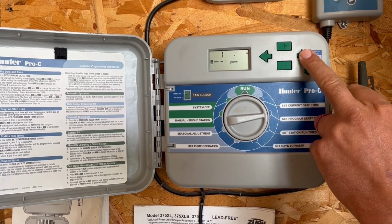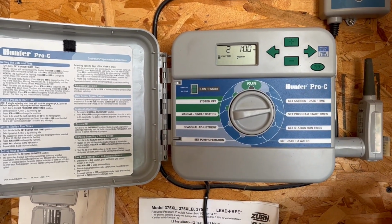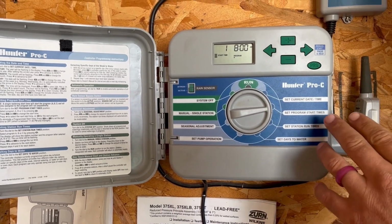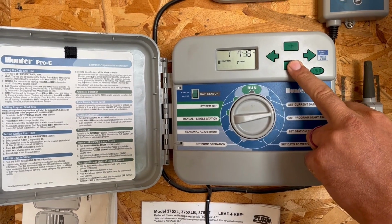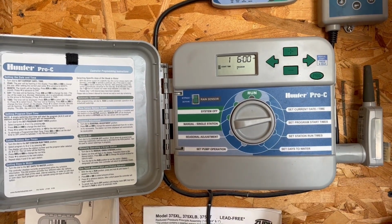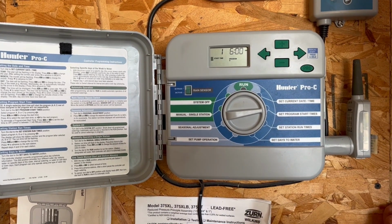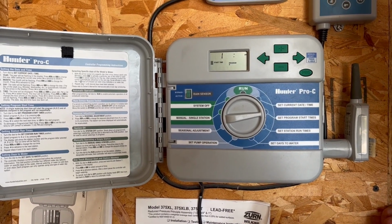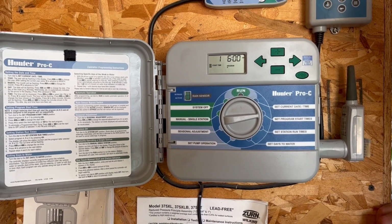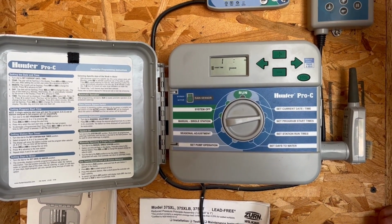Obviously, we don't need 3 or 4 different start times. We can do it with 1 or 2, depending on how long these cold temperatures last. But we want to start a little bit earlier than 8. I would say let's start around 6 in the morning. You can look at the hourly forecast and see when we start dropping below 30. I know 32 is freezing, but it's not going to freeze right away. So if we can run water sometime when it's starting to drop below 30, that would be fine.